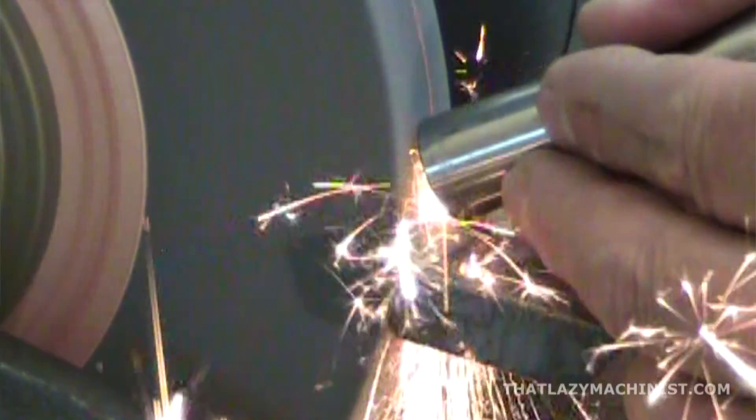But tools that get very thin on their points, or very sharp, tend to melt easily. And that's a problem with lathe high-speed steel tools, or even milling tools. The abrasive, however, is very resistant to heat. So it will remain sharp even if we're cutting very thin chips at a high rate of speed.